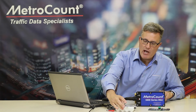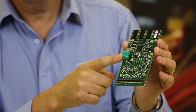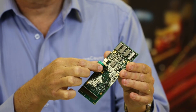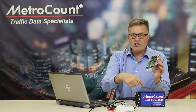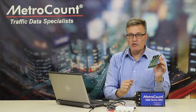So what's the RAM backup battery? The RAM backup battery is a small NiCAD battery which is soldered and physically attached to the circuit board. The RAM battery provides backup of data should you change the battery out, or if you leave your loggers on the shelf. The RAM battery will maintain the logger's memory and its personality, remembering things like the signature.